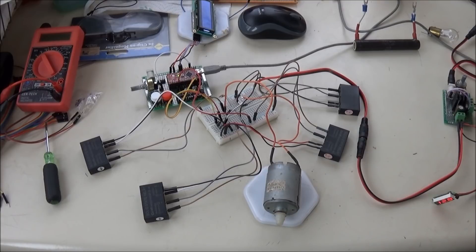We've discussed a number of ways to build H bridges. A fellow engineer in Africa wanted to know how he could build an H bridge setup to handle 160 volts, as he was experimenting with an electric car. In the past we have been stuck using opto couplers which only go to about 30 to 40 volts, maybe 50. Trying to find an opto coupler to switch on a MOSFET, particularly on the high side of the H bridge, you just can't find them.